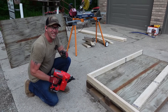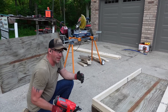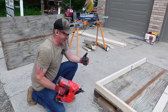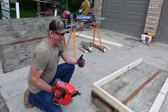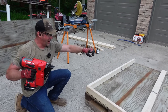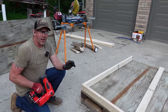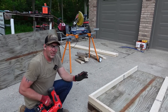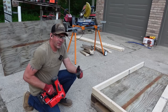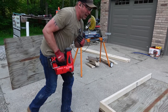I'm a little gun-shy running this nail gun because when I bought it for the bathroom remodel, I always heard of people shooting themselves in the hand and thought — how can you do that? I didn't realize you could hit a knot and get a ricochet. I was toe-nailing a board in at 18 inches, it hit a knot, and the nail went right into my thumb bone — it shattered my thumb. That probably delayed the kitchen project. But if you're wondering how people shoot themselves in the hand with a nail gun — ricochets, or working too fast. In my case it was a ricochet.